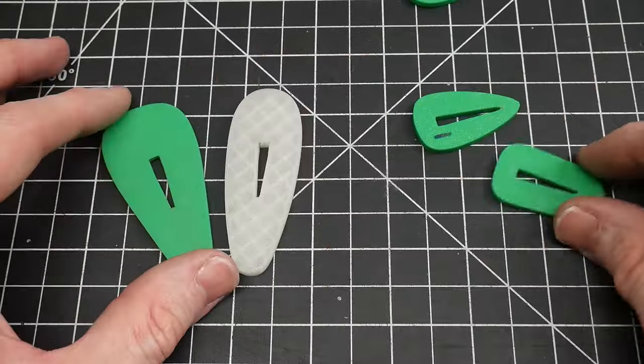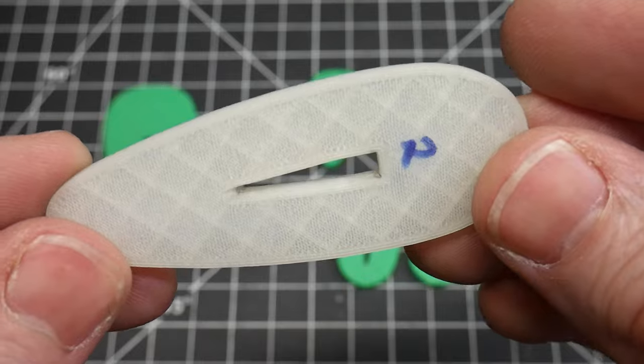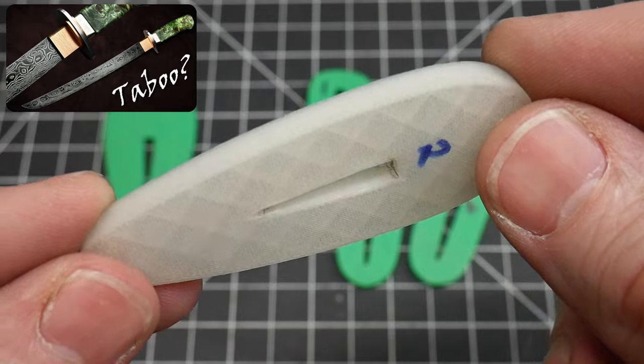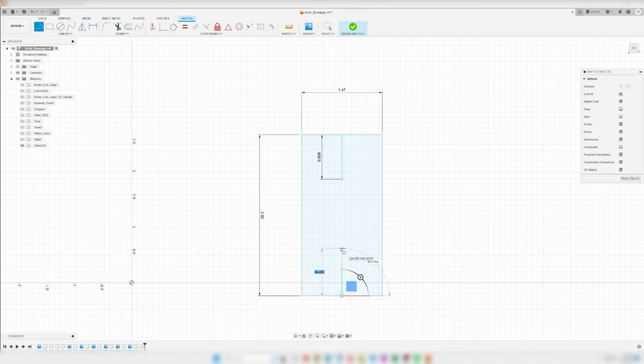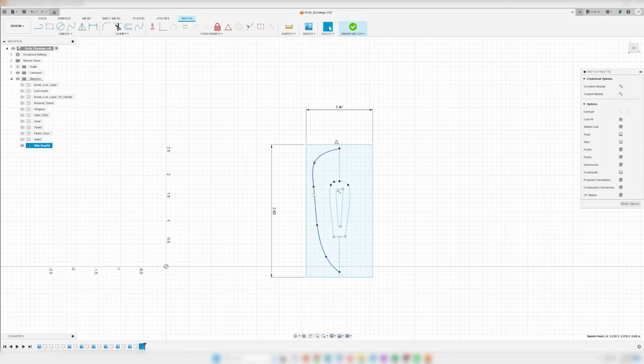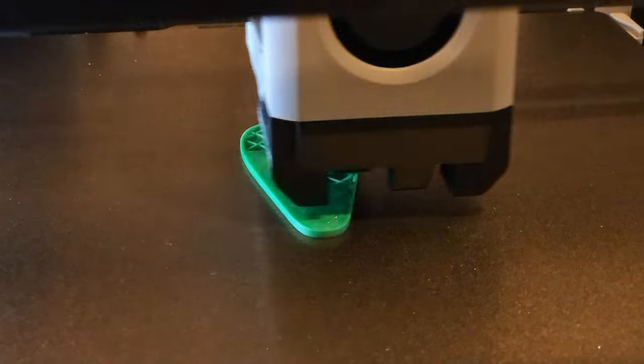The second of the three projects is using this printer to make hidden tang fitting templates. I recently used this technique on my samurai challenge build and it worked great. The process is to measure your tang for slot dimensions, then draw up your guard or spacer in Fusion 360. This gives you the option of printing out multiple versions of the guard to see what it will look like on the knife before grinding them out of stainless steel.